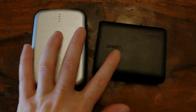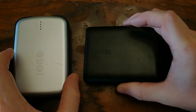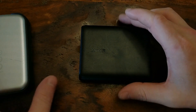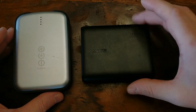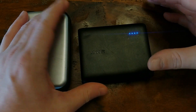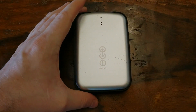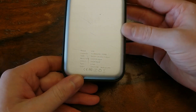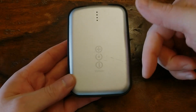You still have to be careful about the exact model of power bank, because they don't all function the same. For instance, some don't supply power while they're charging — like this one — which makes them effectively useless for solar projects. What you want to look for is a device that allows for pass-through charging, meaning it can supply power while charging. Another issue is that some have a minimum current shutoff, so unless your device is drawing a certain amount of current, the battery will automatically shut itself off. This battery, however, from a brand called Voltaic, is specifically made for solar applications — it supports pass-through charging and has an always-on mode, meaning no minimum current shutoff. I'll put a link in the description if you're interested.